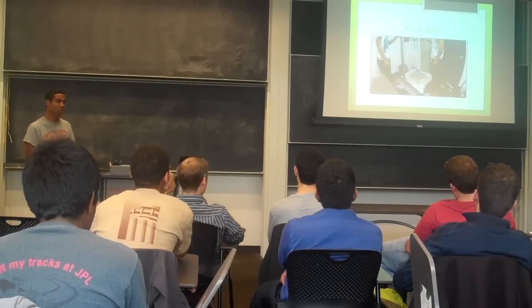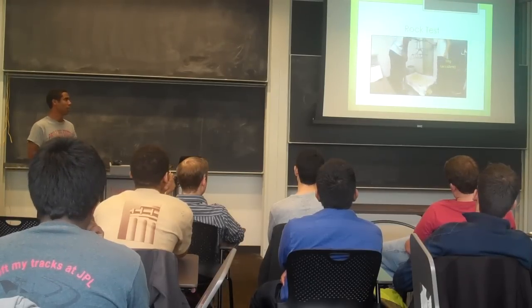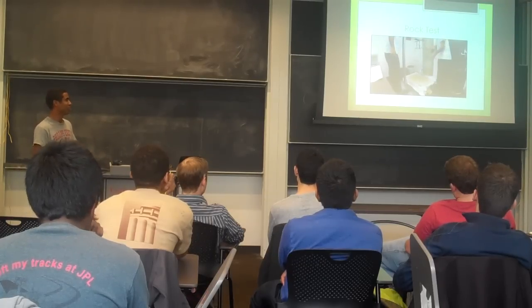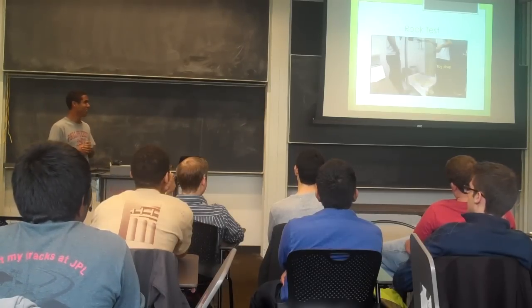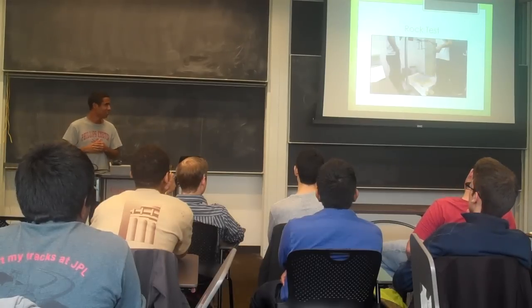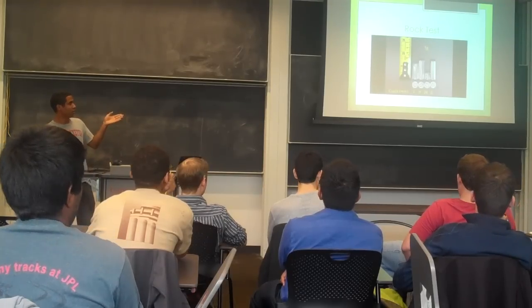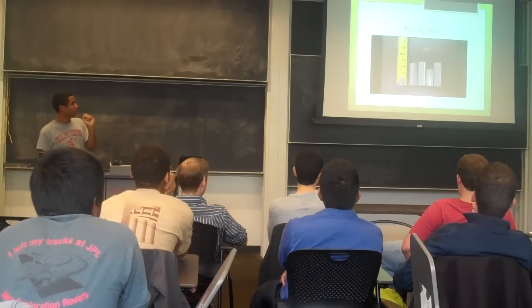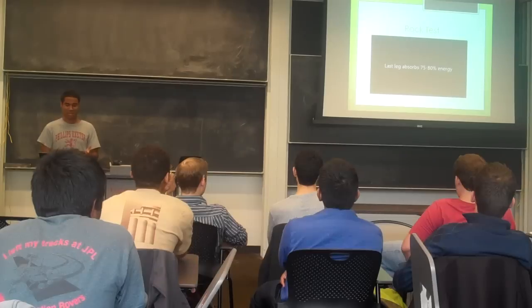So we did that with two different types of honeycomb, the 5G honeycomb and the 10G honeycomb. There was a premature drop due to some oscillations, but we got it working after the second trial. So that's how much it crushed on the 5G. I think it crushed about a third less on the 10G, which is good, because 10G is our worst case scenario.